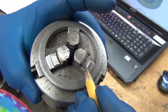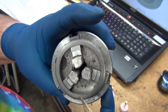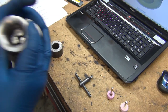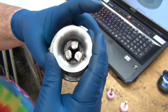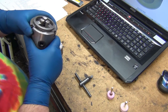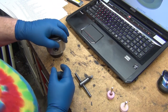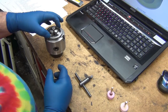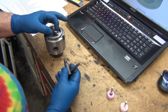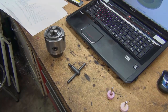I can come in and touch the top of these, graze these off and clean that up and get that set up pretty nice. It's somewhat close to this diameter — that's kind of what I was shooting for, but I didn't quite make it big enough. I suppose I could throw it back on the lathe and open it up a bit more. It's not like it has to be hugely strong — I can only generate so much force with the little chuck and the key. Another eighth of an inch would be nice because I really wanted to get that more or less round right at the diameter of the ID of the slug.